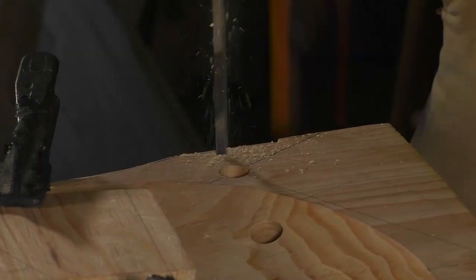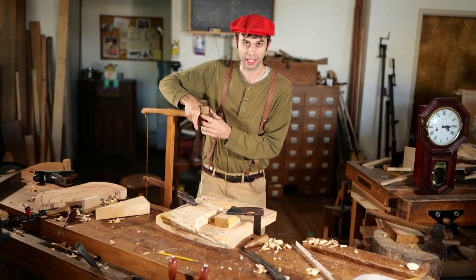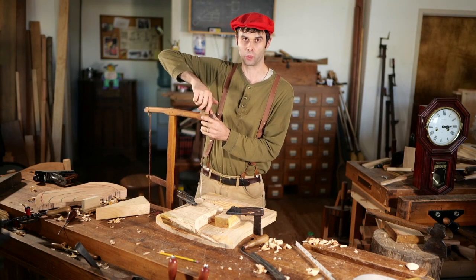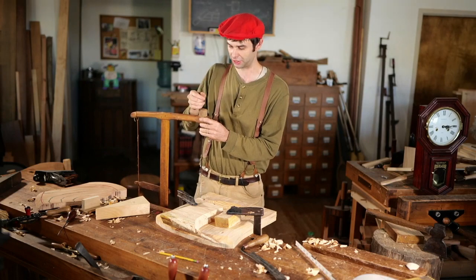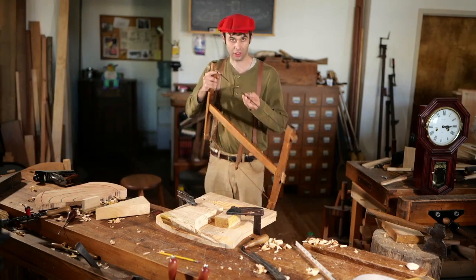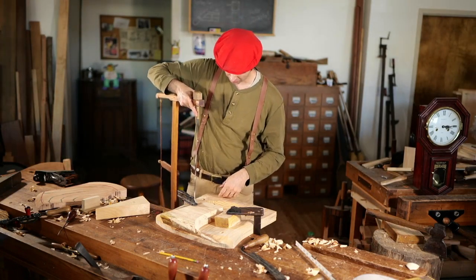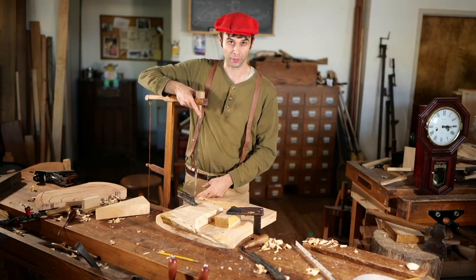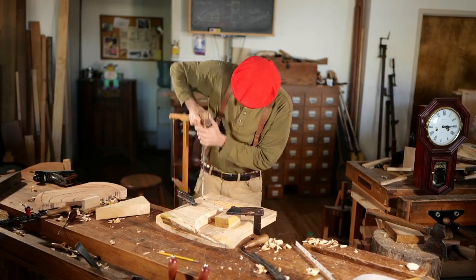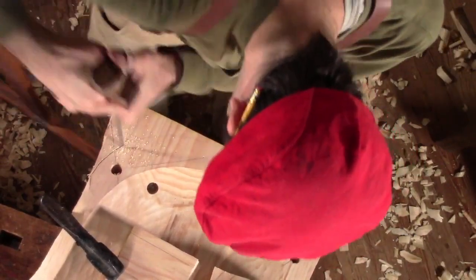You can pretty much go right to your line. I'm using this hand up at the top to pull the saw slightly forward. Some saws have really long handles, but they're just for turning the web — they're not really a place to hang on, because it tends to turn the web. You want to make sure your web is all in the same plane, that one side isn't cocked more than the other. Otherwise you'll never saw a straight line if it's cutting one way up here and another way down here.